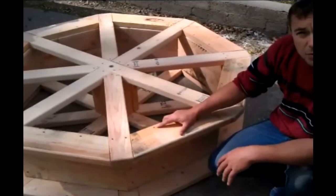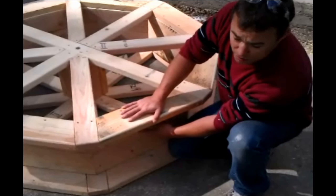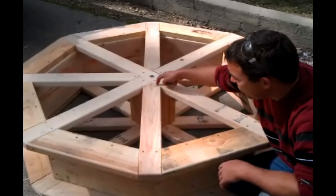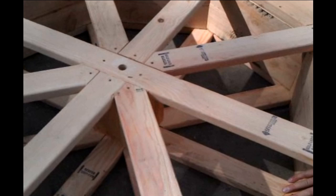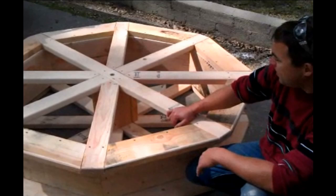The inside was round but I wanted to do it fast so we banged this out. I did tweak a few things from the video I saw, but basically it's made with 2x4, 2x6, and the center is a 2x12. The inside here is just some 45 degree mitered points. All these pieces on the outside and inside are cut at a 22.5 degree angle. This center block is basically just some 2x6 that I screwed together.